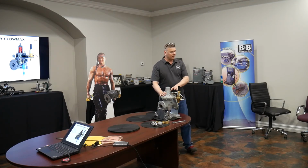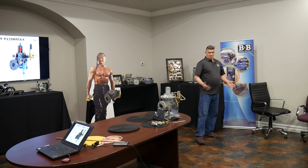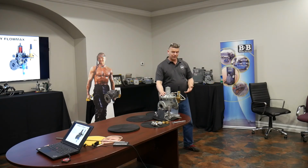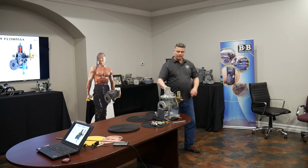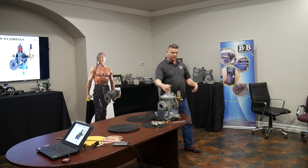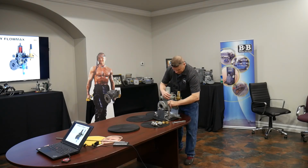The standard way that the valve would come in fully configured is okay for the downstream reg. That's fine. Personally, though, if they get into the habit of just running their sense line from the pilot, like everything else, and just have this plugged and know they have to run a return line into the downstream piping, that would be better in my opinion. Jeff's got a revised drawing of that with the correct way to plumb that.